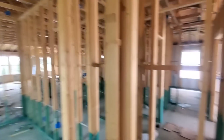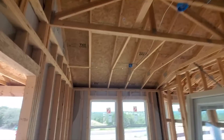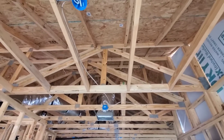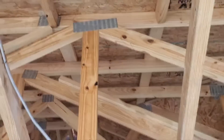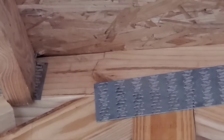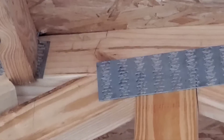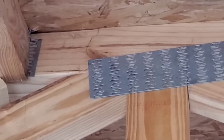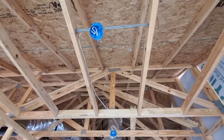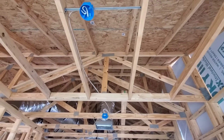Something I want to show you over here in your breakfast area. Now, it's gonna be kind of hard to eat breakfast if the roof falls on your head. I don't think that's likely, but this crack in the truss certainly does not help. See that little black line up there right in the middle of the screen? That is a crack at a knot — that's a potential failure point if this truss gets stressed. It's definitely not gonna meet its design load capacity.